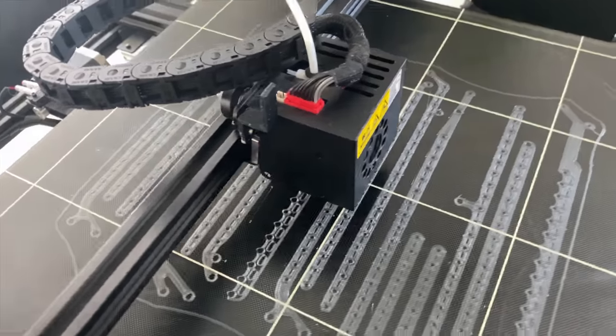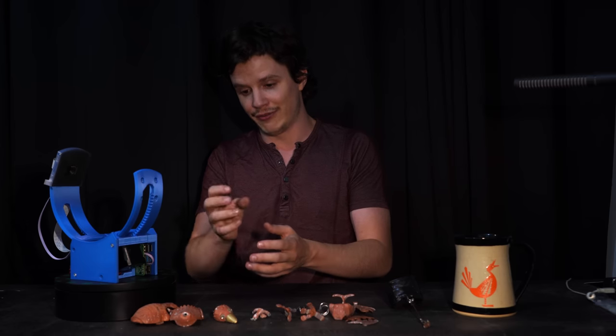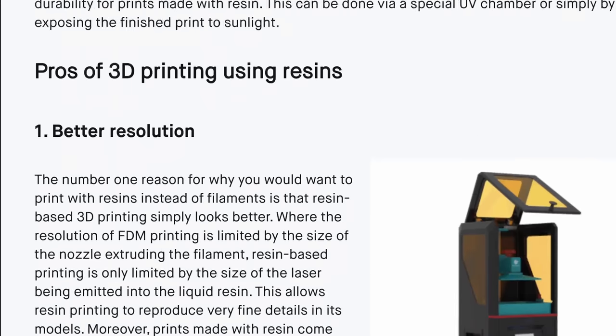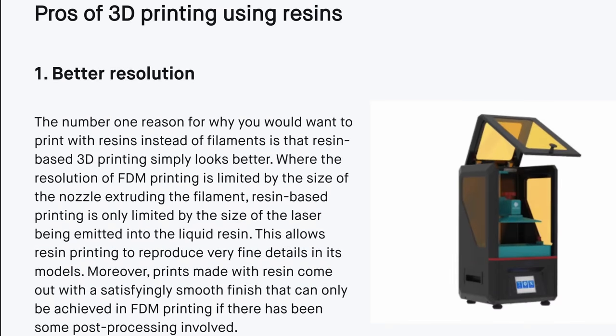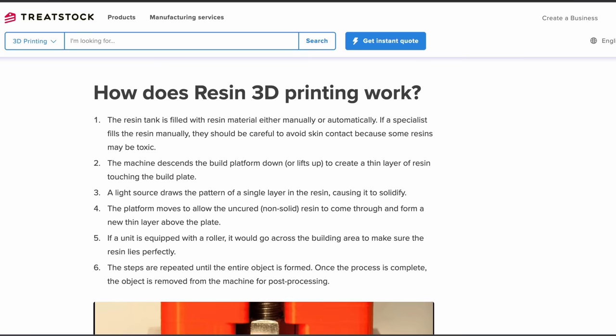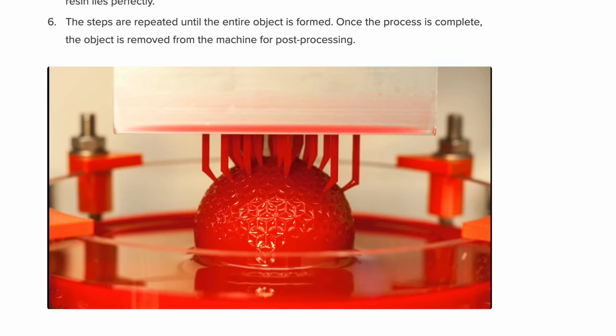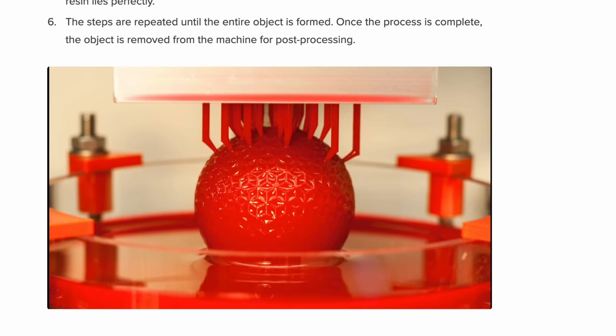The problem is, the 3D printers I've used in the past are good for printing large-scale things, but not so good for printing smaller-scale things and finer details specifically. So I looked into a different type of 3D printing that uses resin and is able to get those finer details. After a little bit of research, it was clear that resin printers have been capable of getting the detail required for a project like this for a number of years. So I was able to look at things that weren't necessarily cutting edge, but were more reliable and tried and tested. I much prefer those things. They're also cheaper too.